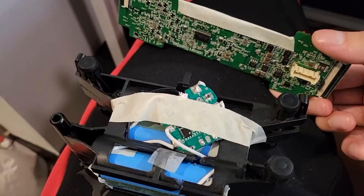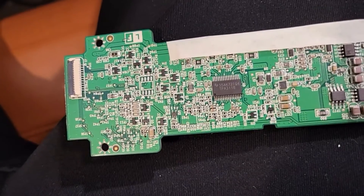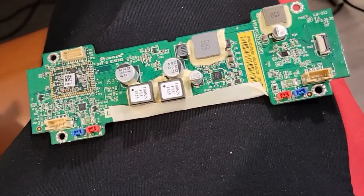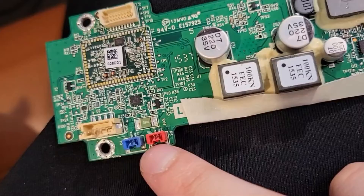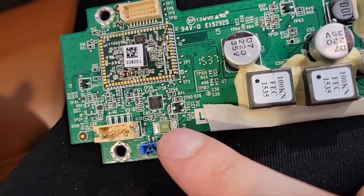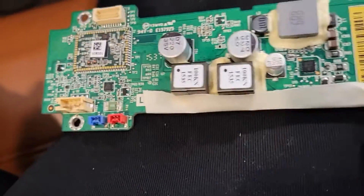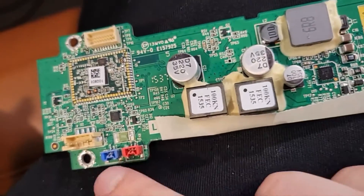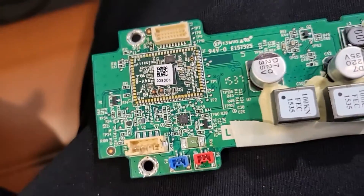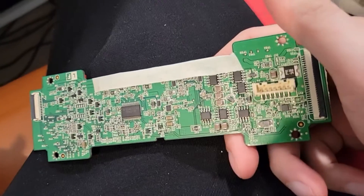This is the circuit board itself — pretty interesting. It's using a single stereo amplifier, the TPA3118. There's no active crossover or anything. The tweeters are crossed over with capacitors — I think one is on the board. Either way, they all get full-range signals, and these woofers are also playing full range.